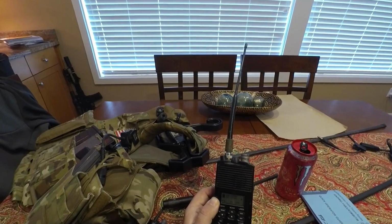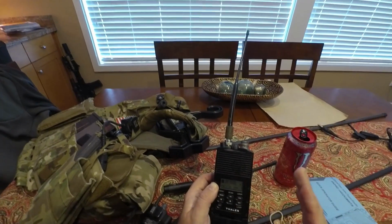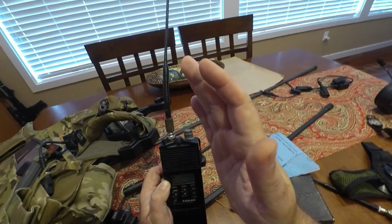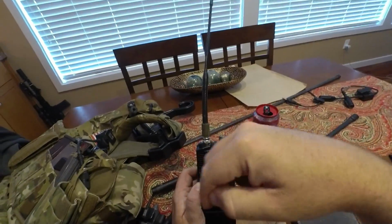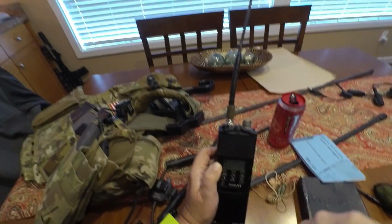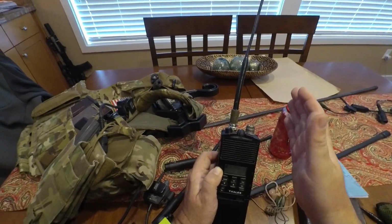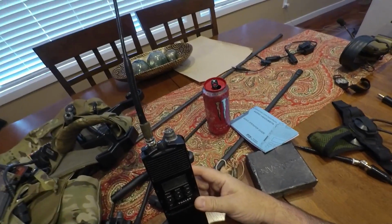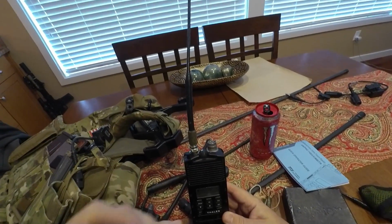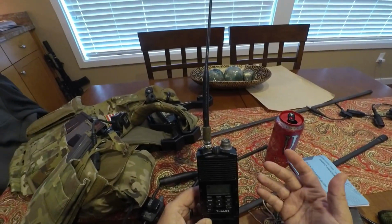And when you have broken transmission, that usually means that based off of atmospherics and line of sight, even the guy turning while he's talking can mask the antenna and put himself between the antenna and who he's trying to talk to. And so if he's talking out loud on target with his mic keyed and walking around in the house, some of that RF energy is going to get out cleaner and push further than other RF energy that is masked by additional walls, the guy's body, whatever. So you'll get that choppy, "here, next, built, 14," and it just sounds all jacked up.